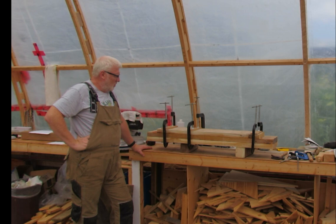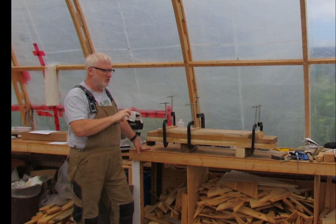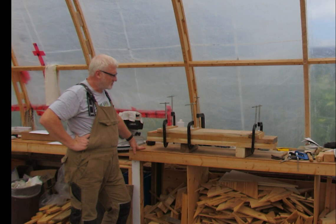And so I decided on that, essentially working in 50 gram increments for the resin. Poured in 50 grams, thought, no, that's not gonna be enough. Poured in 100 grams, thought, okay, that should work, and then added 20 grams of the hardener. And that gave me definitely ample to do up these three timbers, 2 4-foots and a 3.5, with some to spare.